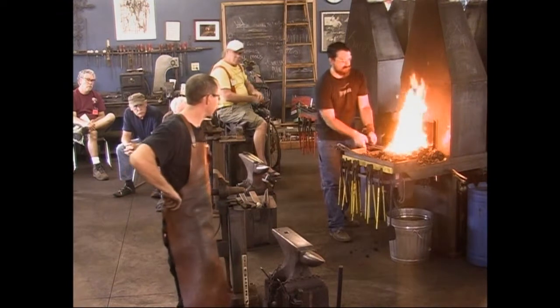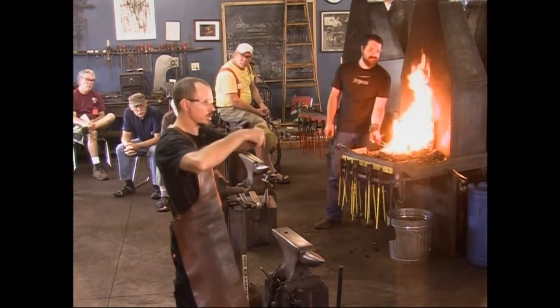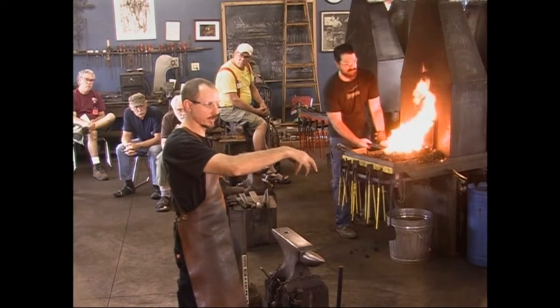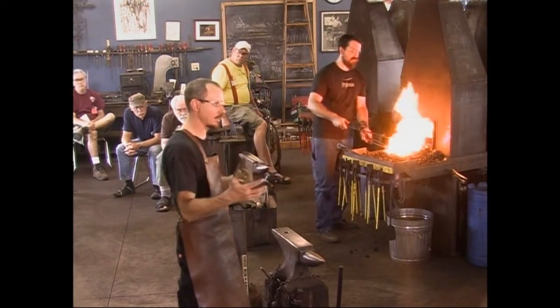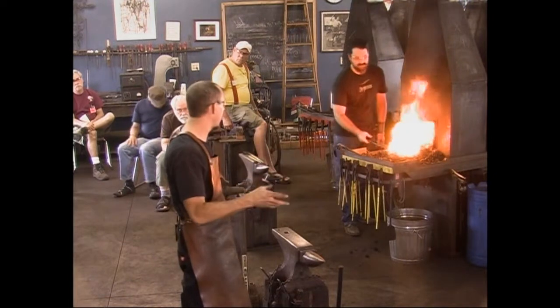Back to the gas forge I have at work. It is a Swan Portaforge, which has two burners. It's really nice because the two burners are near the back, and so they create a hot spot in a gas forge. Sometimes that's really inconvenient, but I can make good use of that. Even though the whole thing is being heated in the gas forge, I can still selectively get certain parts really, really hot.